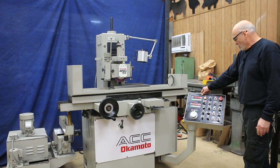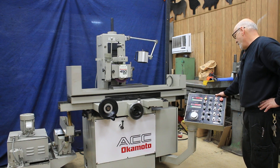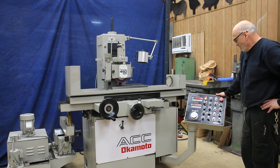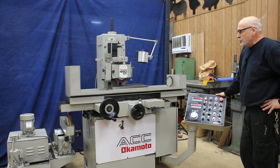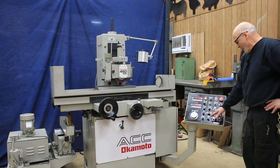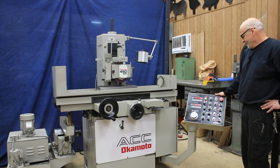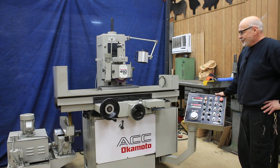This is going to work its way down to zero, going through a coarse feed, then into a fine feed, and then into a spark out. Right now it's in between the coarse feed and the fine feed, just doing a little spark out — now it's feeding down again. This machine is currently wired for 480 volts. You also program how many spark out passes you want, and when the spark out is done the table is just going to come and park.